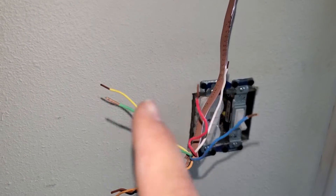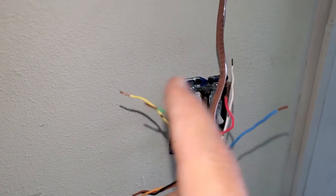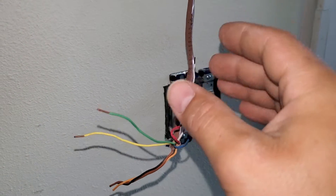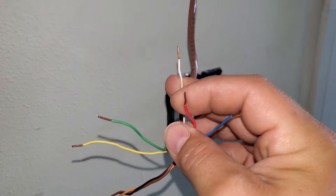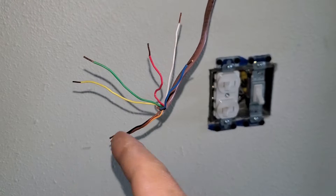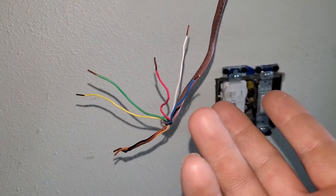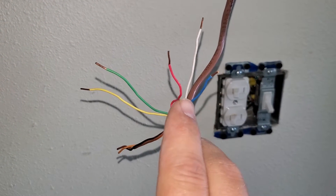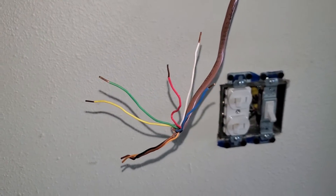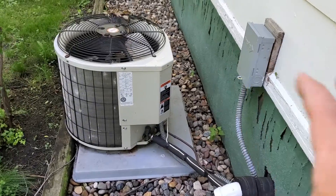Now, technically, if you shorted the red out to these other colors, it wouldn't necessarily blow the fuse. If you short the red to green, it'll bring on the fan. Red to yellow brings on the compressor and the air conditioner outside if you have a standard system. And red to white brings on the furnace. Common basically acts as the neutral in this situation — it's the return path to the frame of the furnace or to the other side of the transformer. The common terminal is used to power thermostats. A lot of smart thermostats require a common wire. So if you haven't moved your thermostat and don't think that would have caused your fuse to trip out,